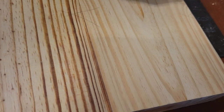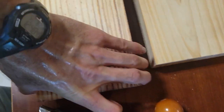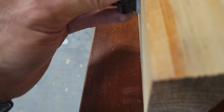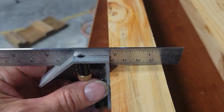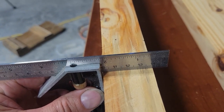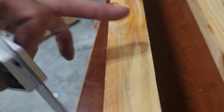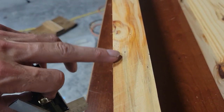What I can do is lay it flat on a table and I can rock this piece — I can show you how I can rock it and close up that gap. Basically going to assume it's probably not perfectly square. You can actually see there's a very tiny gap right here between this square. So we know that we're a little bit heavy on this side and a little bit low on this side.